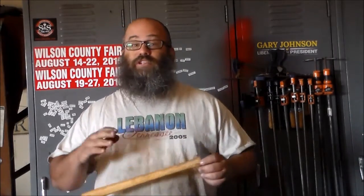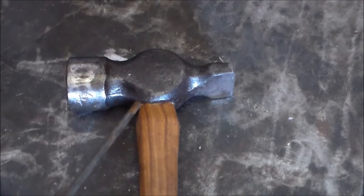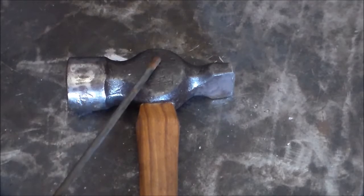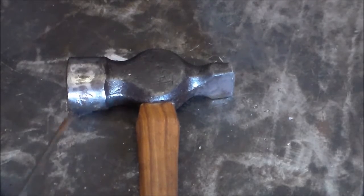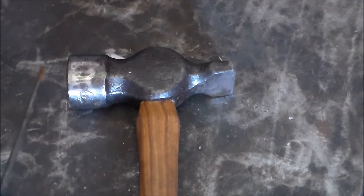What I want to talk to you about today is I want to show you what the peen — the straight, narrow peen on the back of these hammers — is for, and I want to show you some of the different types of these hammers and what they do. I'm going to use this Swedish-style cross-peen to show you the different parts of a hammerhead. The eye is the part that goes through the hammerhead. The cheek is the piece on either side of the eye — the top and the bottom as it's laying here. The pole or the bell is this fat part here in front of the face. This is the neck, which is a smaller part between the cheek and the pole or the bell. Not all hammers are going to have a neck. And the face, which is the large working end of the hammer — some hammers will have two faces.